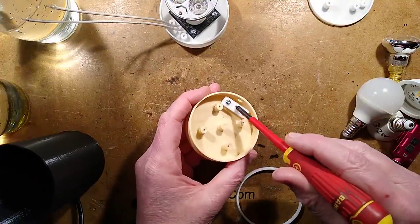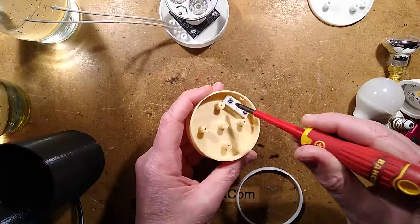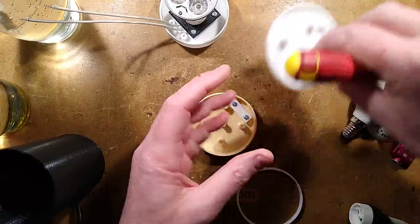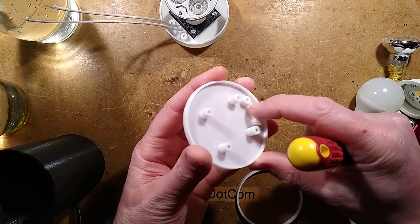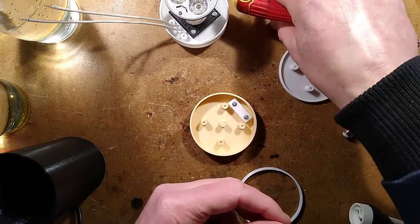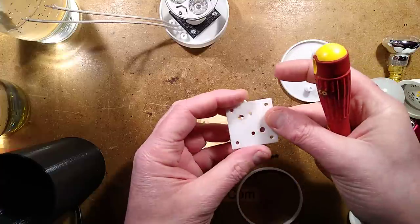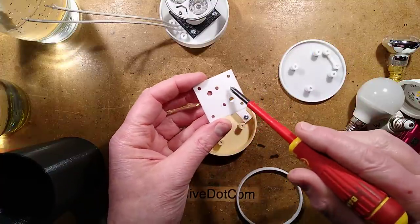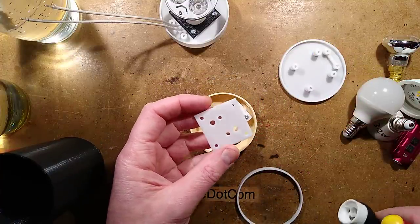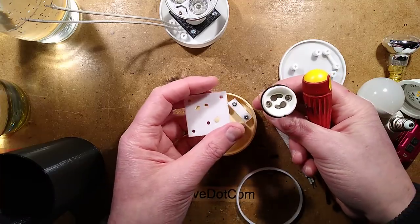This one is a little plate designed to match the cable restraint bar, which has the two outer pillars, and then it's got that little bar that the cable gets squished against, but don't squish it too tightly, for the sake of the cable. Another thing it'll print off, the other file, is for this plate. This plate is designed to take a classic ceramic GU10 lamp holder.